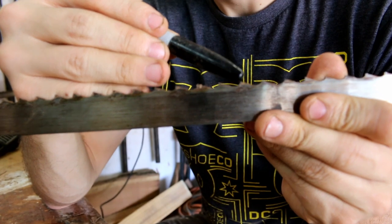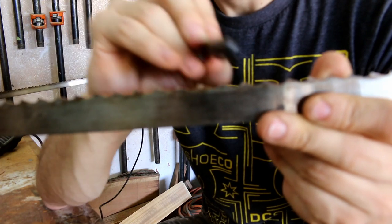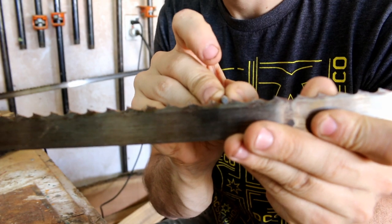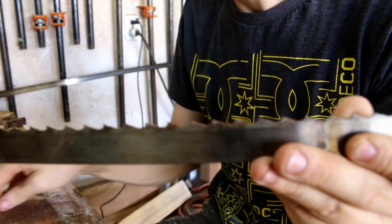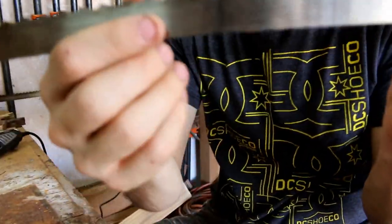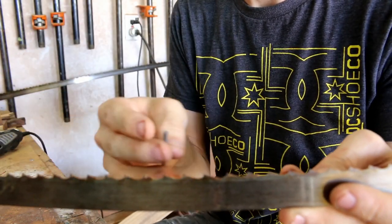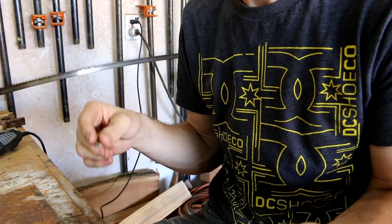As you can see, these faces are more perpendicular to the back of the blade rather than sloped upward. I'm going to use this bit to hollow out this portion right here — go in a little bit and scrape this area on each individual tooth. I'll start at the weld, which actually happens to be right here — I didn't plan that, that's really cool. I'll put a piece of tape around the weld so I have an idea where I am at all times as I go through each tooth.